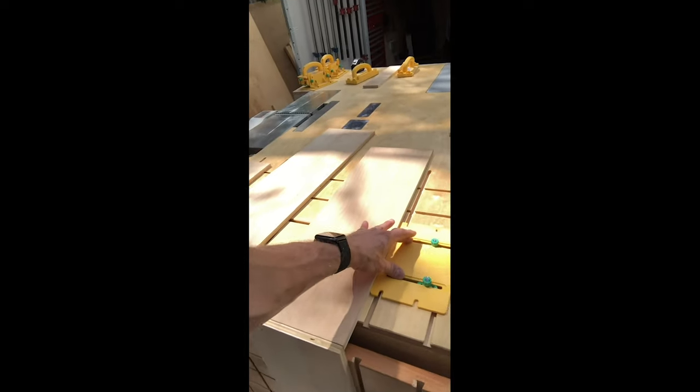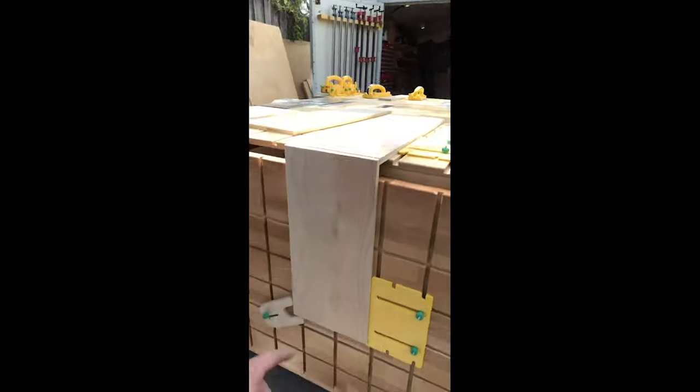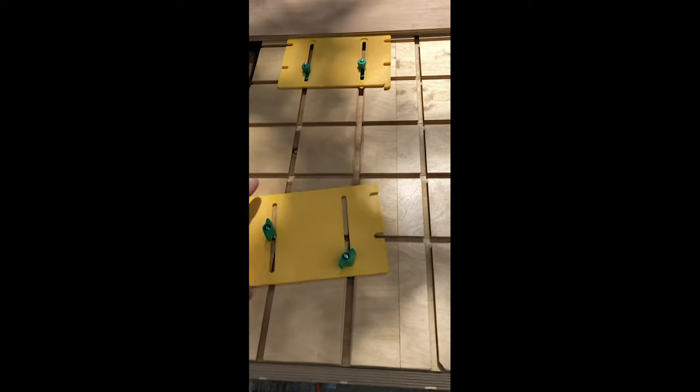Here's a fun trick — if you have a Gripper Advance, you should have one of these stabilizing plates. The slots on here are four inches, just like standard match fit spacing, so I'm actually using them as stops for setting up these drawer boxes — you get 360 degrees of movement. The little hook here can be used as a stop on the bottom. If I was making 10 drawer boxes I'd definitely want stops set up so that as I assemble two parts, take them off, put the next ones on, they just go right where they're supposed to be without having to align anything.